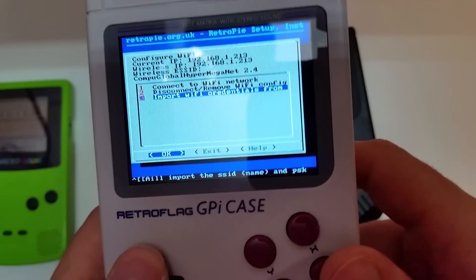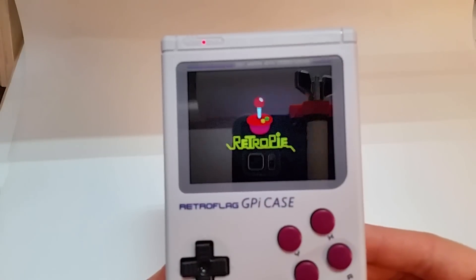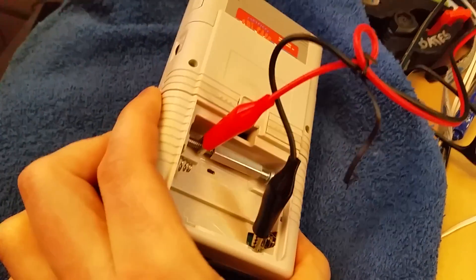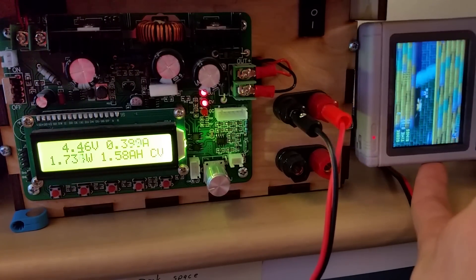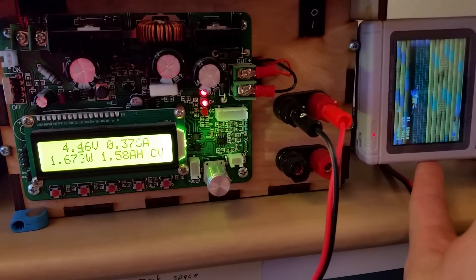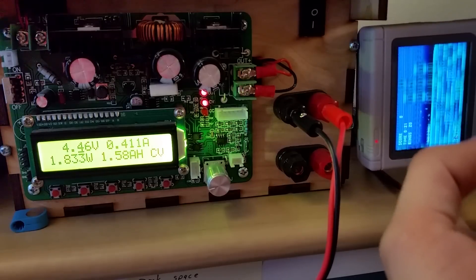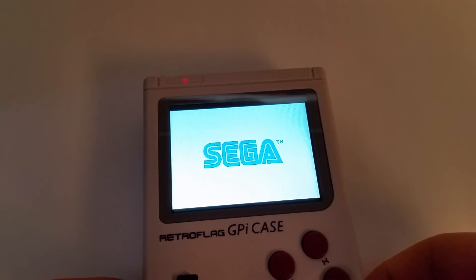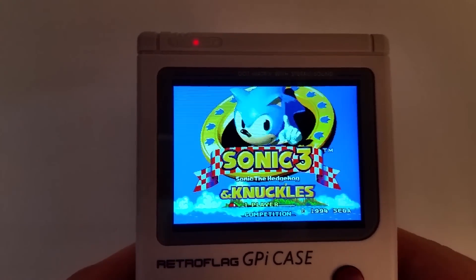I just want to talk about this thing because it's obviously very neat. Power this thing on — startup is a little slow, it's a Pi 1, but there are ways to speed that up. I wanted to look at how much power the screen is actually consuming, so I rigged up my fake battery connected to my power supply. At low brightness we're at around 350 milliamps, and at maximum brightness we're at about half an amp. Most people are reporting with this case they get about three hours of use, and I'm at the three hour mark having this thing on and idle for shooting this video. You could put a lithium-ion battery in here and make an adapter, but just having three AA's — that's half of what the Game Gear used. We've come so far in 20-some years.